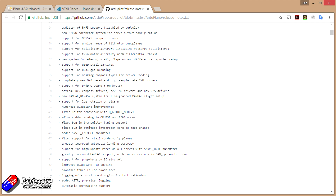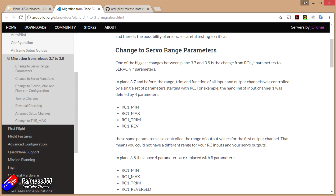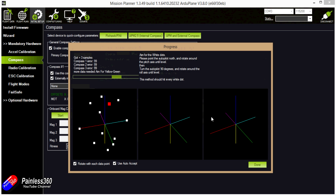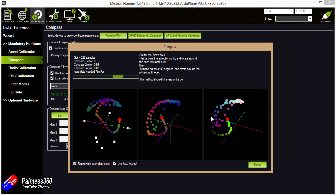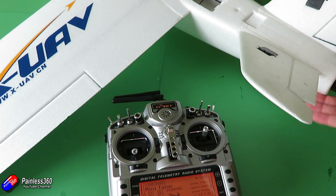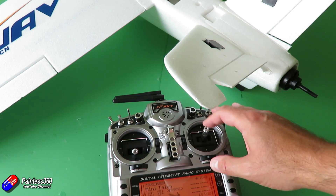There's a new filter added. The way that RC inputs and RC outputs are dealt with in planes has been completely redesigned, which is one of the main reasons I've been waiting for ArduPlane 3.8. This video focuses on one specific topic: making sure everything's moving in the right way and the correction is too. I got into a real mess with this, so once I'd figured it out it was worthwhile documenting it, because I'm sure other pilots and builders are going to make the same mistakes.